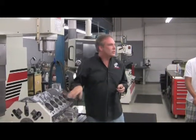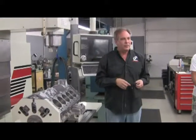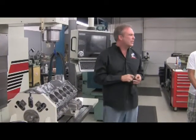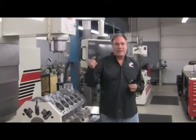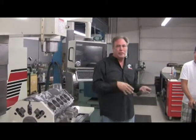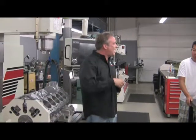Modern BMW engines, and not just BMW, Mercedes, Porsche, Audi, they're all doing this now, is a block that's called Alusil. What that means is there's no steel sleeve in it. There's a high content of silicon. I think it's around 33% of silicon. It's basically like making chocolate chip cookies. You have the aluminum molten, and you take the silicon, you dump it in, and you stir it, like chocolate chip cookies, and the silicon mixes up in the aluminum. So it's not that there's a coating of silicon. The silicon is impregnated in the entire casting.